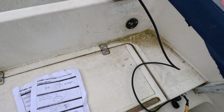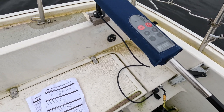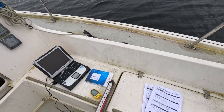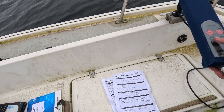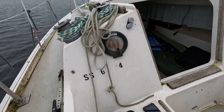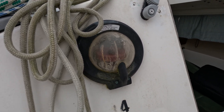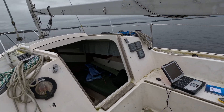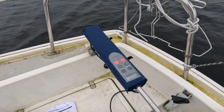We hit standby for one second — that's it. Let's see how straight this keeps us on the way back in. One thing I'd recommend is that you can actually see your compass. Setting to 220, hit auto. Hopefully that's it calibrated — we're sitting at 243, everything's matching up, the compass is matching up.